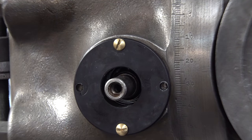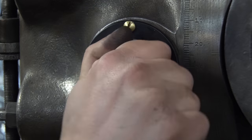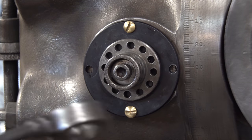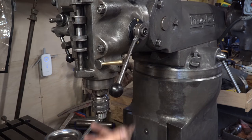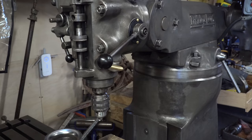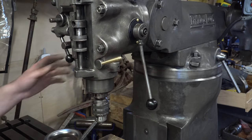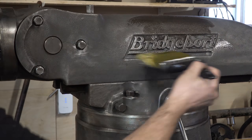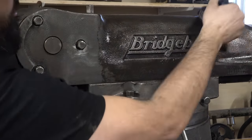For Bridgeports, it doesn't work like a drill press. The tension on the quill is only meant to keep the quill in its exact position when you let go — it's not meant to return it back up to the top when you're in a drilling motion. So if I set it down right there, it stays. If I'm up, it stays. If I'm down, it stays — it just stays wherever I leave it. You can increase or lower the tension a quarter turn to adjust. It's kind of nice knowing that if I accidentally hit something, the quill is not going to drop down onto the workpiece or table — so it's a safety thing as well.